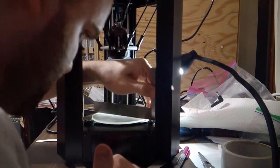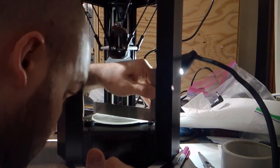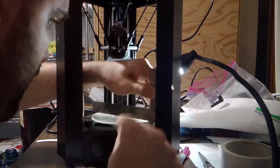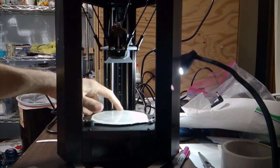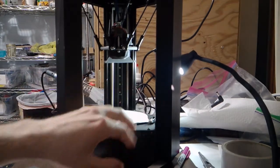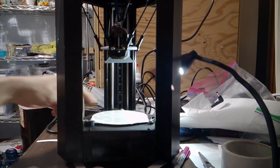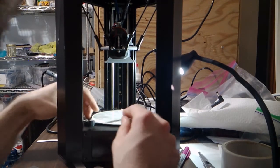And oh, I got to move to this rail, because you want to make sure you don't touch the bed clip, you just want to touch the rail and the bed. Alright, perfect. So now we're just going to stick shims under these two sides, because this side has the highest edge of the bed, so I need to shim these other two up until the bed's evenly square to the rails on all three towers.